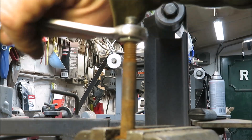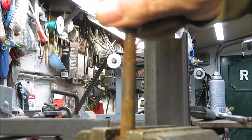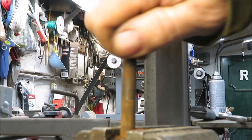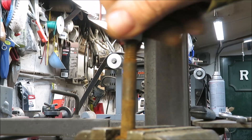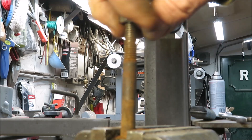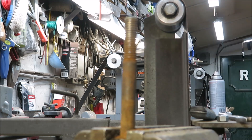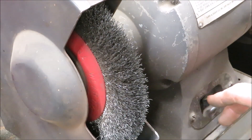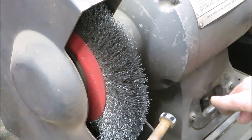Roll that thing right back off — you can actually turn it with your fingers now. You could do this a couple of times, run it down and run it off. Look at that — I'm just twisting that right down on with my fingers, and that is exactly the same way your nut would go down on there. So then I would take it over to the wire brush and clean it up. You might need some eye protection and maybe a pair of gloves.